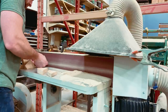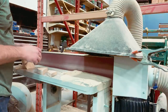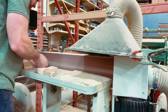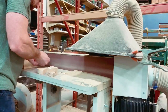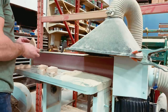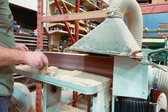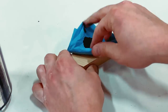You can see we've got a couple of vacuums hooked up to the sander. If you're doing this on a belt sander at home, try to make sure you have dust extraction — it's important. Wear a mask, especially if you don't have dust extraction. Also, if you're sanding small pieces like this, find some other way to hold them if you can. I acknowledge I'm being a little bit foolish here — this is one of those 'do as I say, not as I do' circumstances. One thing for sure: do not try to do this wearing gloves. Any kind of power tool where something is moving — a sander or a saw — you cannot be wearing gloves. That's a good way to hurt yourself really bad.